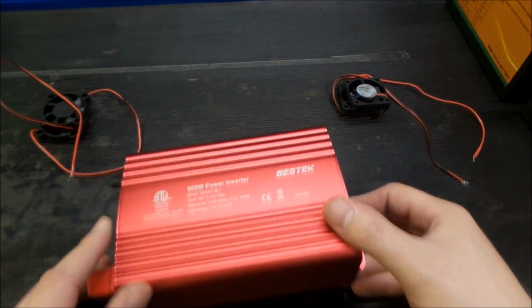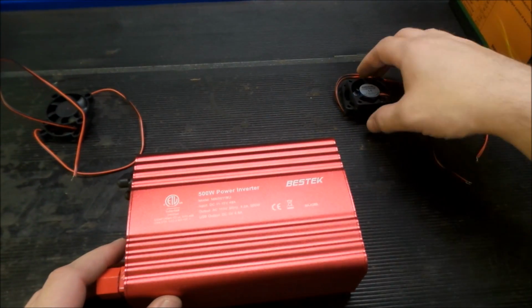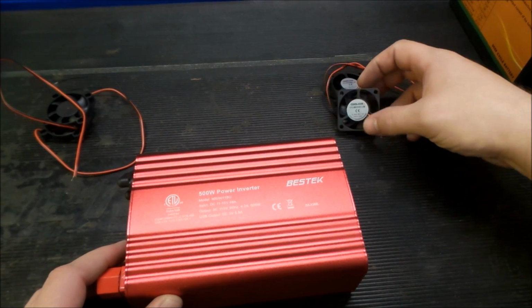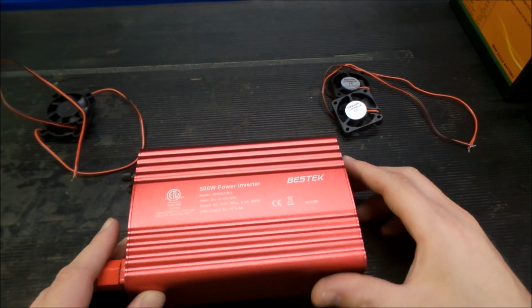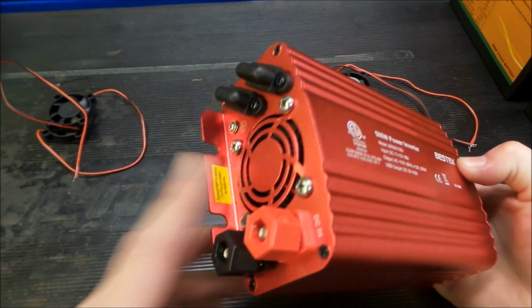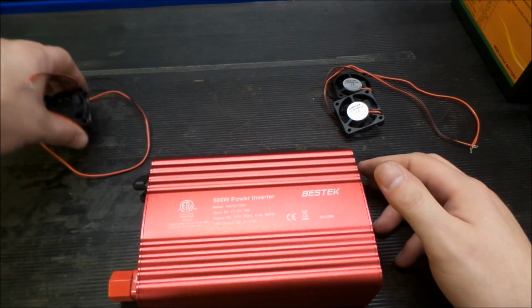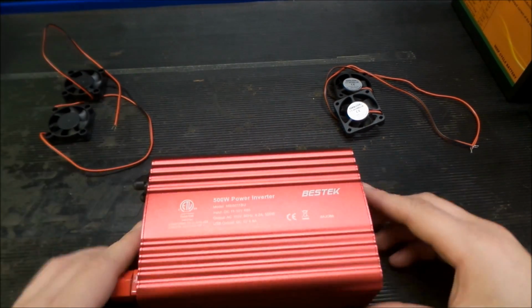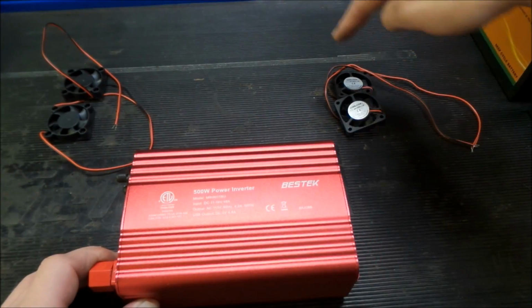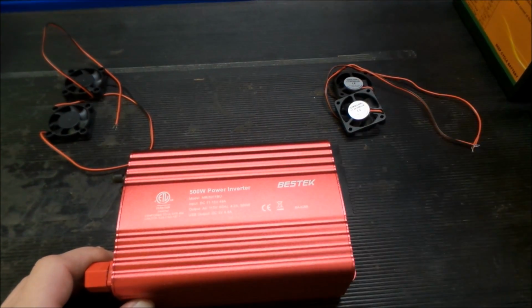So now we know in our container, our PACKOUT, we're going to have two fans mounted this way, discharge being on the label side, this being our intake side, this being our outtake side, and then two fans mounted this way. So what we'll get is a nice airflow through our cabinet around the batteries.